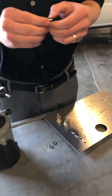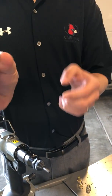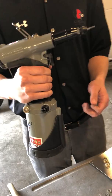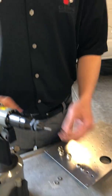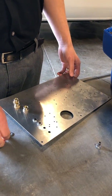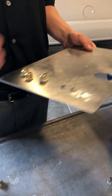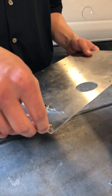Today we are going to be installing the CC-SS10-180, a stainless steel 10-32 rivet nut. We will be using the 4090 pull-to-pressure Cardinal installation tool and we will be installing into .160 material thickness — that would be a base plate with two washers, and then the rivet nut will go through the two washers and the base plate.